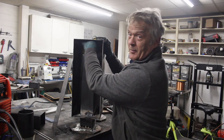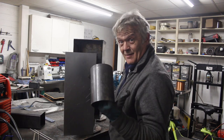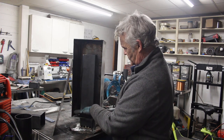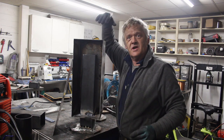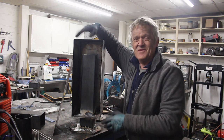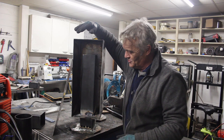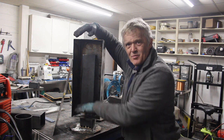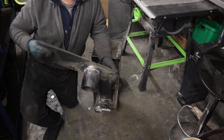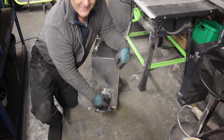That's it. Now the gases and heat will come up here, be swept into this chamber. There'll be a back plate on it, and that will get welded on there — it's that bit that goes into your flue. Now, people say put insulation in here — bring it down to the floor and pack the insulation over there. They say it improves efficiency, and it probably does, but I just don't think it does that much. You don't want to keep the heat in; it's a room heater, you want the heat out. So I don't do it, but it is suggested if you want to. Now I've drilled a hole and welded a bit of pipe on there. All I have to do is weld the back on — and that's it.